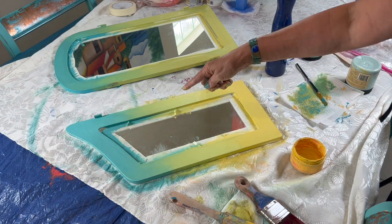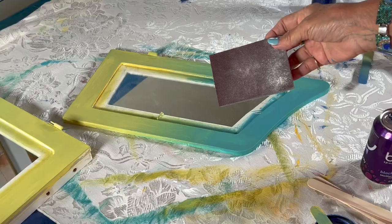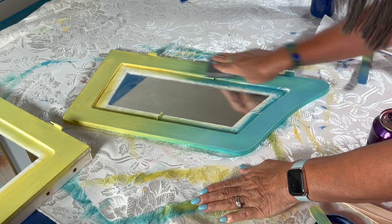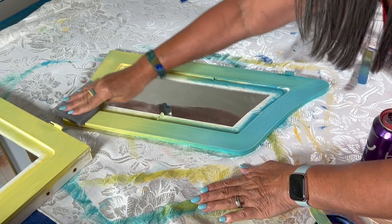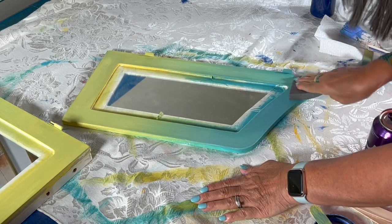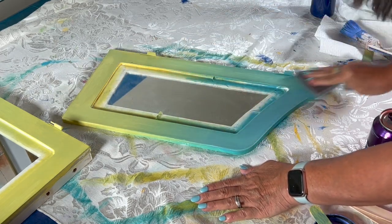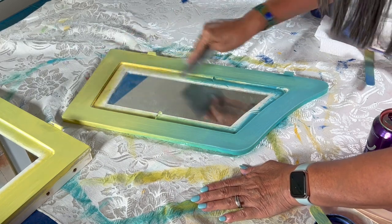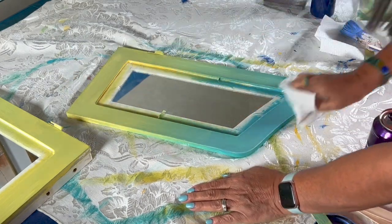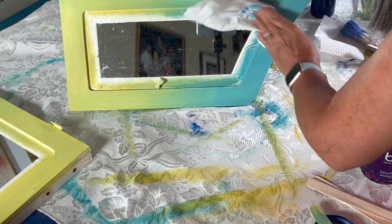With a small brush I'm going to go around the edges of the mirror. After it's completely dry, I like to go over lightly with a 220 grit sandpaper before I apply my second coat of paint — this gives a more smooth finish to the surface of your furniture. This is just an option but I really recommend it. After that I make sure I clean it so there's no dust or paint residue, because you want your second coat of paint to adhere perfectly to the surface.